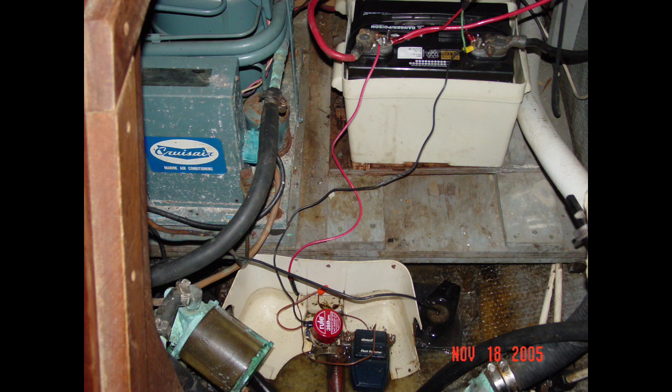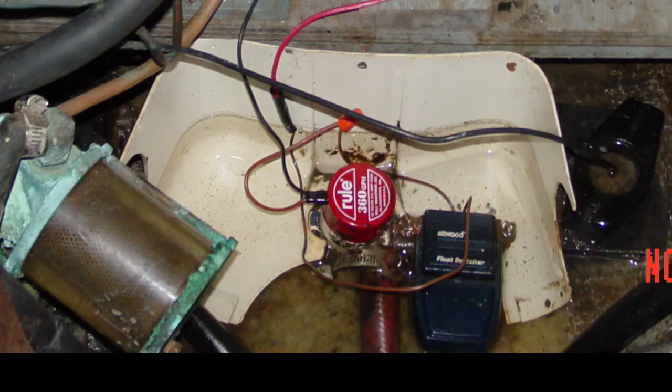Take a good look at this photo — it provides a cornucopia of bad things you'll find on boats. First up, the bilge pump is wired directly to the battery without the use of a fuse or circuit breaker for protection. Bilge pumps must always be protected by an appropriately sized fuse or circuit breaker. Also, the bilge pump wires are not properly secured — wire runs should be secured and supported at least every 18 inches. Additionally, while the bilge pump has an automatic float switch, it does not have a manual on switch. Every bilge pump installation should always include a manual on and off switch in addition to any automatic float switches, allowing the pump to be energized in the event that the float switch becomes inoperative.